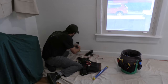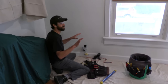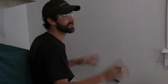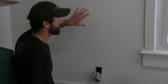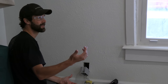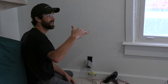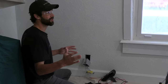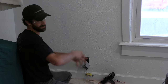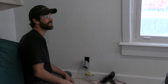Good question, and you're asking the right question. So this house being just rewired was in a totally different ballgame than when it was 1915. What we've got is obviously lights and receptacles on a separated circuit. The fan — I haven't even unboxed it yet, do you know if it has a light kit? The fan itself is probably about a half-amp load when it's on high, so it's 1/30th of the overall circuit capacity. Motors have such a reputation for being massive high-draw units, but a ceiling fan — half amp is a pretty good rule of thumb.